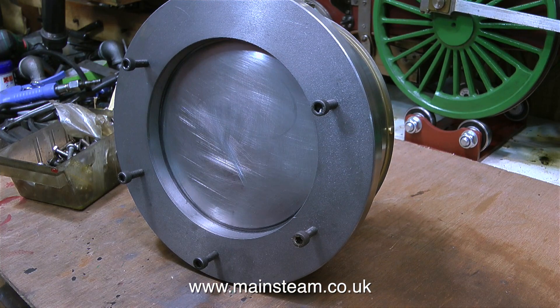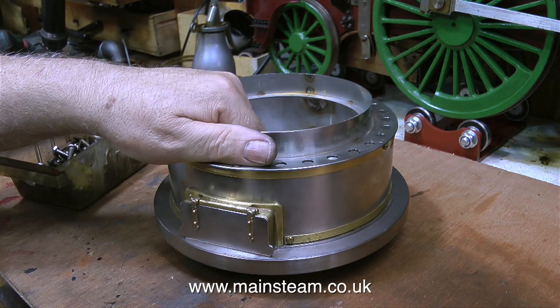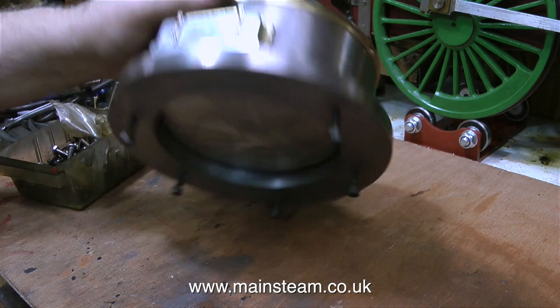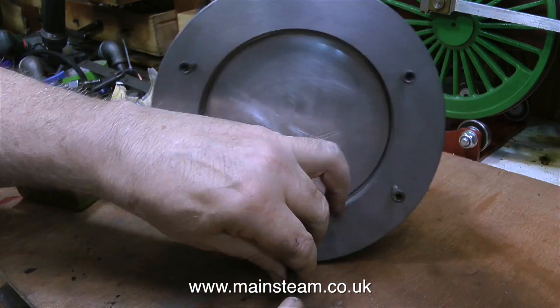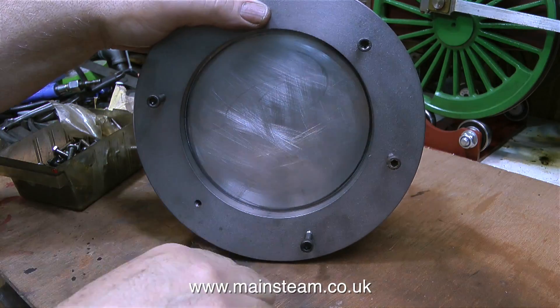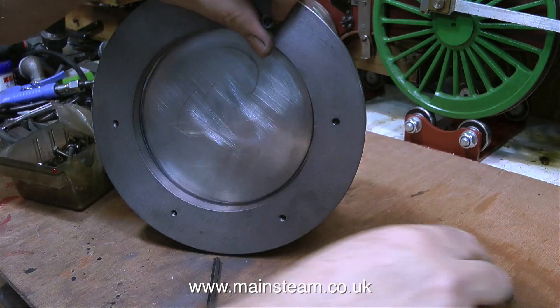The other reason for using M6 bolts is explained here. I could, if I needed to, lift the entire boiler off the bench by putting M6 bolts in the bottom as shown here. If I wanted to elevate the base further, I would have to fit the 6th bolt in place to prevent the boiler from tipping. But I don't need to fit the extra bolt — I'm going to use the 5 M6 bolts to hold this part onto the wooden baseboard.